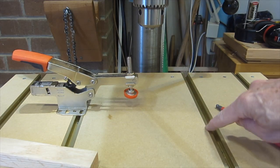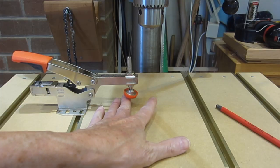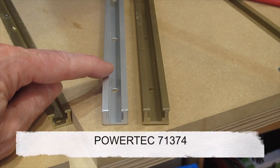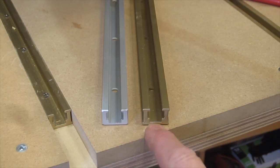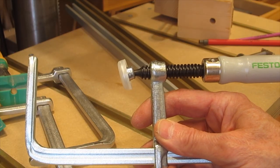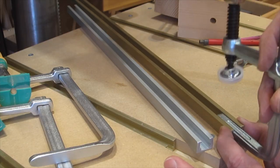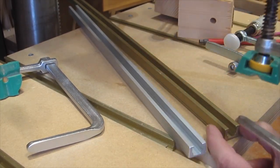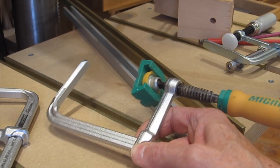I chose a width of 8 inches for this centerpiece of MDF, which allows me to come in quite close to the center so that if I'm trying to clamp a small piece onto the table I can reach it, with one clamp on each side to hold it down securely. On the left is the Powertec heavy-duty 3/4-inch by 1/2-inch track; on the right is the Inkra, also 1/2-inch high by 3/4-inch wide — their cross-sectional profiles are very similar and both accept 30M8 T-nuts. If you want to use track saw clamps, the Powertec is the better choice because they slip right in, whereas on the Inkra they only go in partway and you'd have to do some filing. Similarly, micro jig clamps go in nicely on the Powertec but still catch on the Inkra.